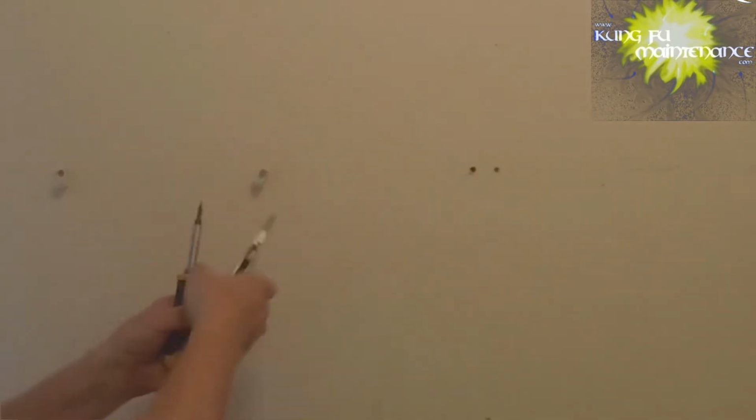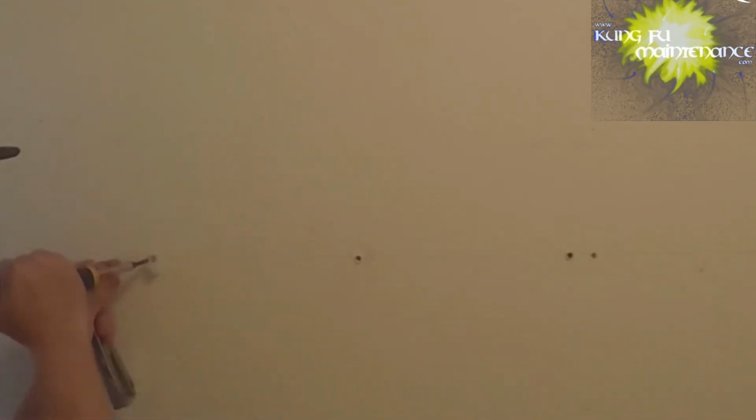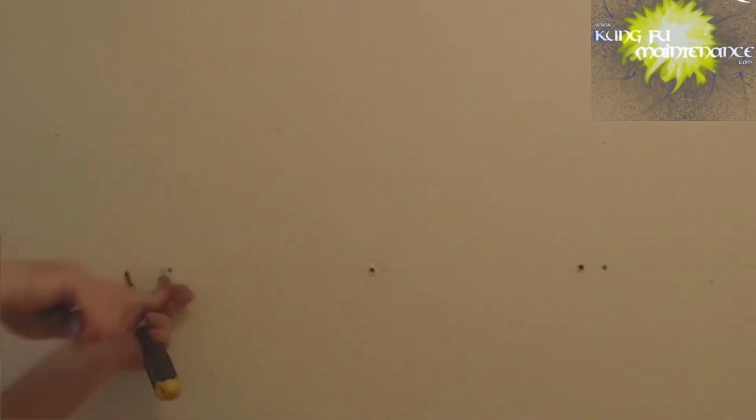I don't have any more of these wire shelves right now, but when I do these to strengthen them, what I'll do is get a wall bracket that has 2 screw holes, so it goes over the very back of the wire shelf, and mount 2 screws right into the stud in between the existing brackets. That just adds a tremendous amount of strength, because then the whole thing's anchored to the studs, but it's also using those drywall anchors and keeping those supported in. That can make them a lot less likely to pull out of the wall, and can minimize work orders if you're at a property where it has a lot of those wire shelves, or if that's at your house. That's just a way to keep things going good. Yep, now just a little patch and paint and we'll be all set.